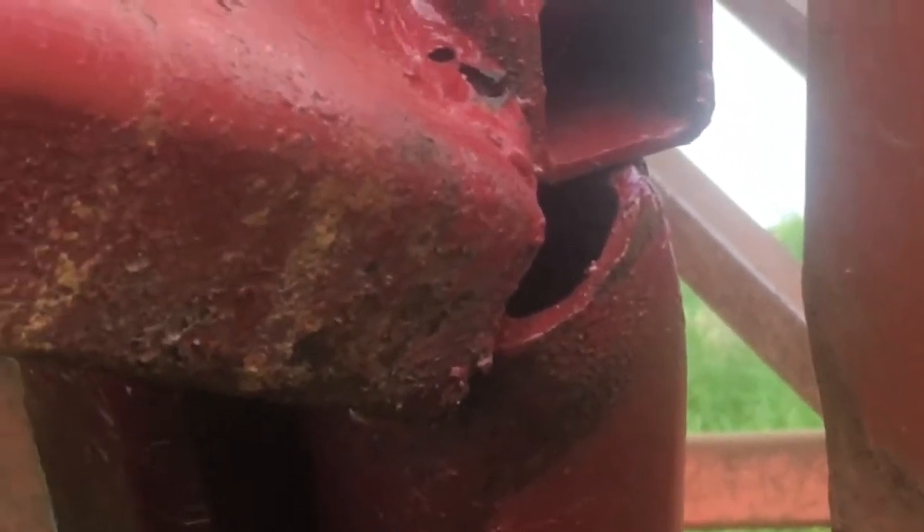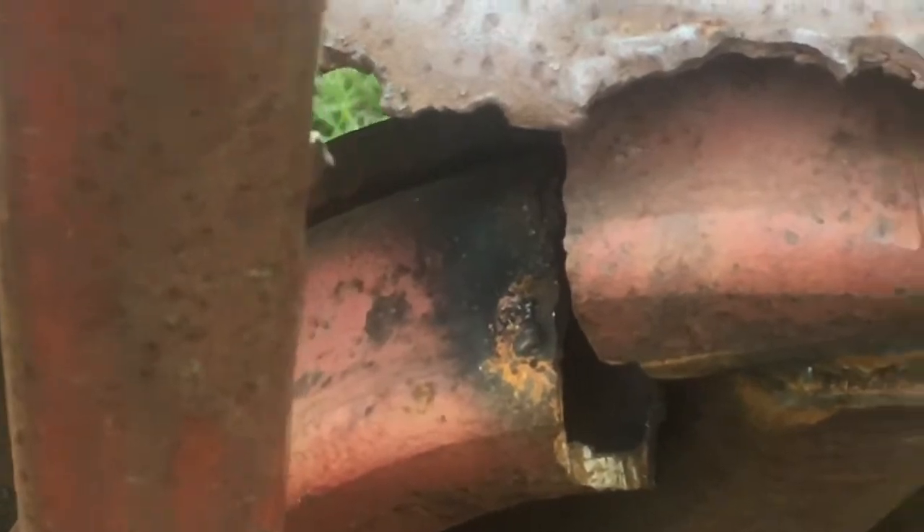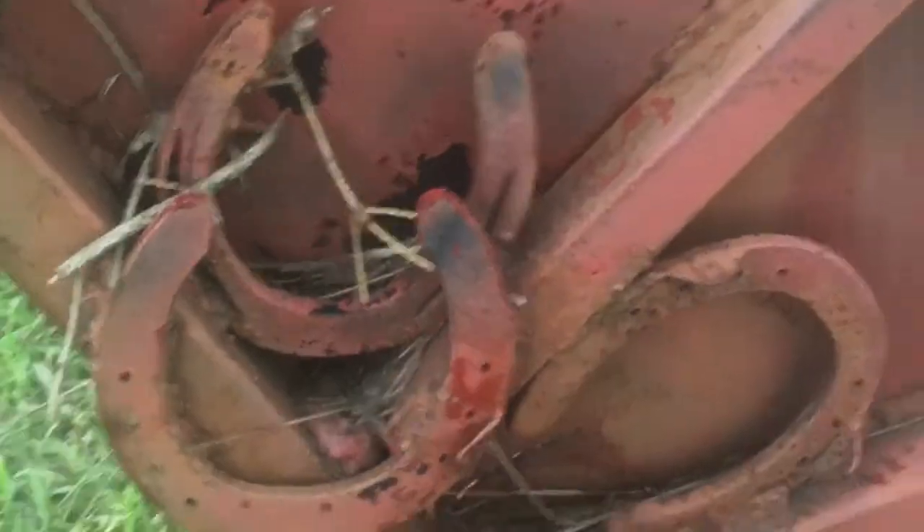This is where I weakened that frame by bending too much and had to come in after the fact and shore it up and fix it. Same thing over here — I had bent it too much. It's a brand new piece of steel now; she's got another 20 years worth out of it. But you can see I had to go there and weld it a different way.